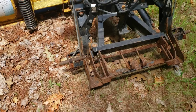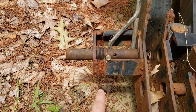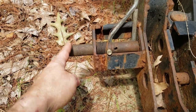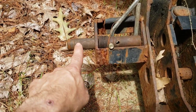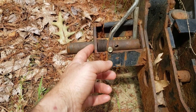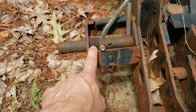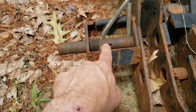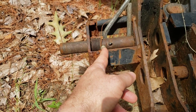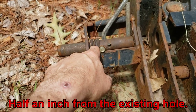So what I did on mine is: I removed the pins, the L-parts, cut them off, ground them down. I whittled this down a bit so it would actually recess in this piece a little bit. Then I drilled a new hole about a half an inch out, because that's where the cotter pin goes for the spring.